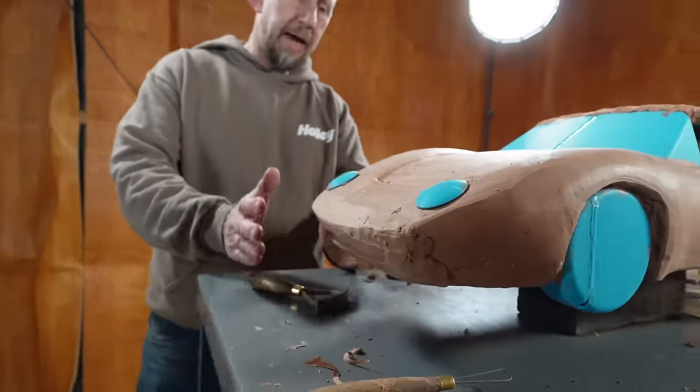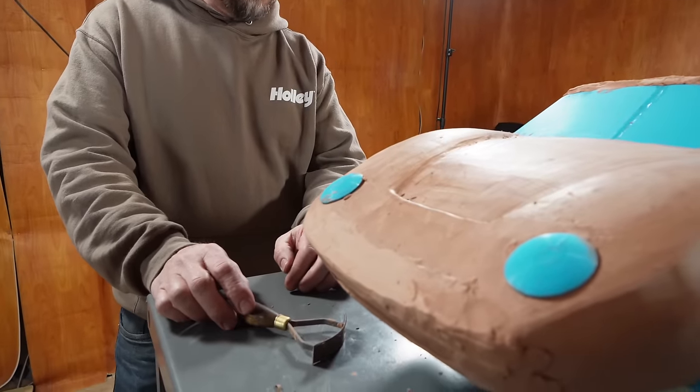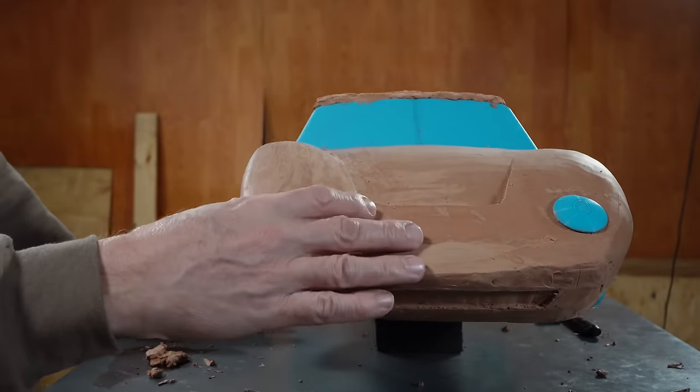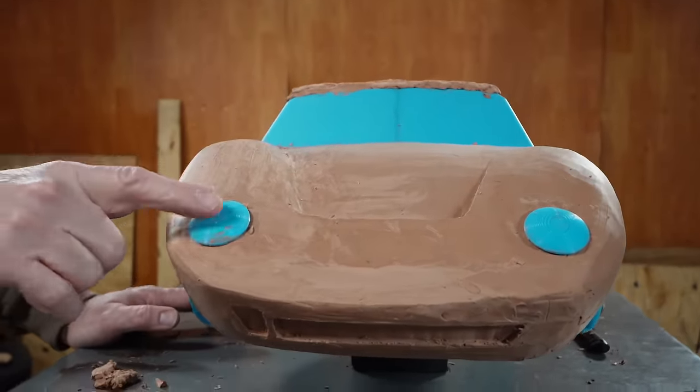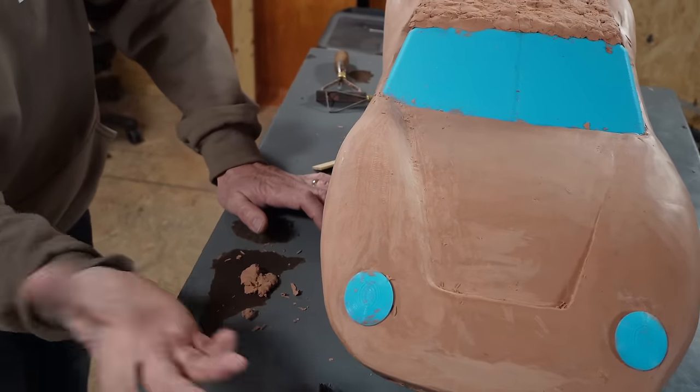So it's feeling a little long in the front end, which it has, and a GT40 or a Miura are both long in the front end. Just knowing mechanically, mid-engine, we don't have a lot up there that we need all this space for. And aesthetically, when we get the headlights close to where we feel like they should be down here in the nose, it's just a very long way from the windshield. And then in the profile, it just feels long.